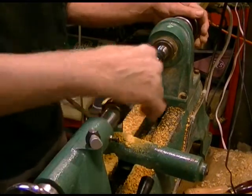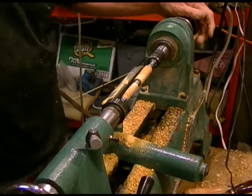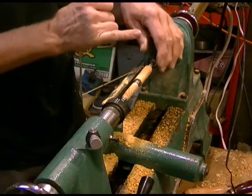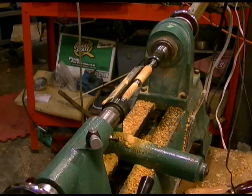The lower is now ready for sanding and finishing. Now let's work on the upper. The upper is a little bit different in that we're going to have a square end and a bluntly rounded-over end. I have a set of calipers already set up for the diameter I need for the barrel of the back of this in order to match where I'm going.